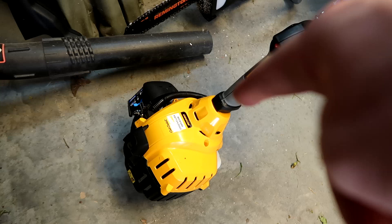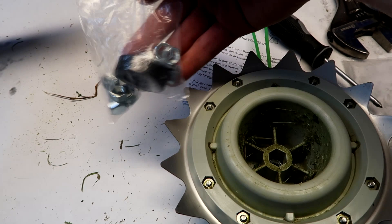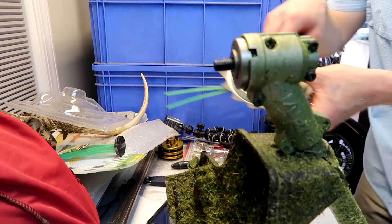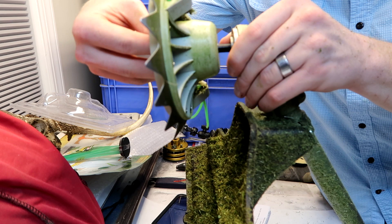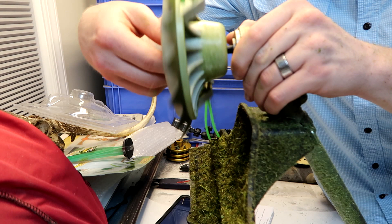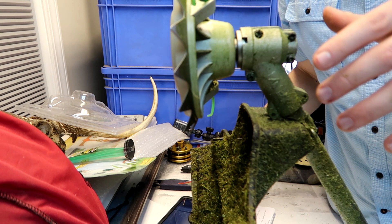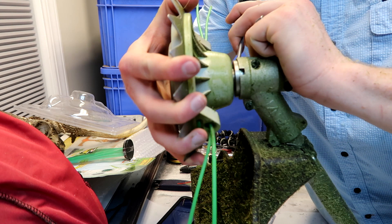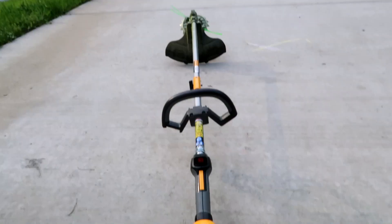I was using the Weed Shark head on the Weed Eater brand trimmer. Now I'm gonna move it over to this more heavy-duty Cub Cadet BC 280 and see how it attaches. Super easy to install — all I did was find the nut in the baggie, dropped it down in there, grabbed a tool, dropped it down in there, then spin the Weed Shark head on. It's reverse threads, so it throws you off which way to turn it. On the Cub Cadet there's a little notch — stick the screwdriver in the notch and make sure the Weed Shark is tightened down all the way.